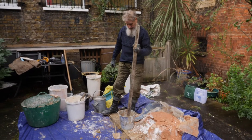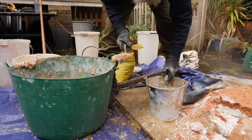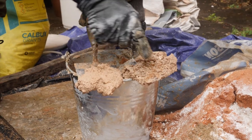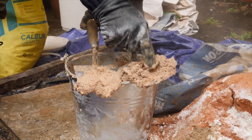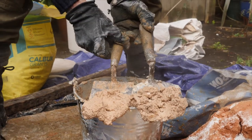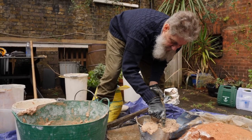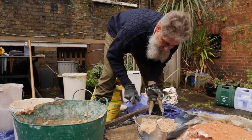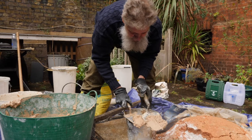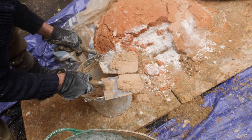We can do a comparison between the two mortars. This one is with lime putty and this one is with quicklime. What's interesting about the quicklime mix is that when you look at early mixes on medieval buildings and many early Georgian buildings, the mortar has a lot of unfired bits of chalk, bits of lime, and coarse aggregate — which is pretty much what we've got here. When that dries out it's going to be a good match to some of these early mortars, and the colour is quite right for Union Chapel because of the red sand.